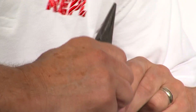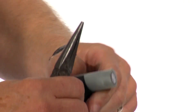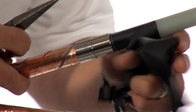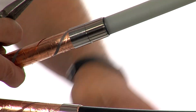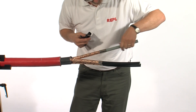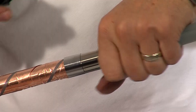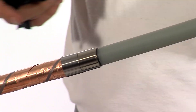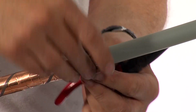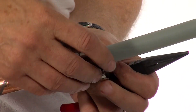With a pair of long nose pliers, pull back the strippable semi-conductive screen. Check to make sure there is no damage to the insulation below. If there is, you may need to abrade out any surface damage using aluminium oxide paper. Repeat this process on all three cores.